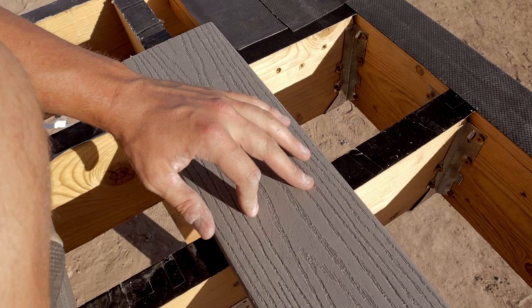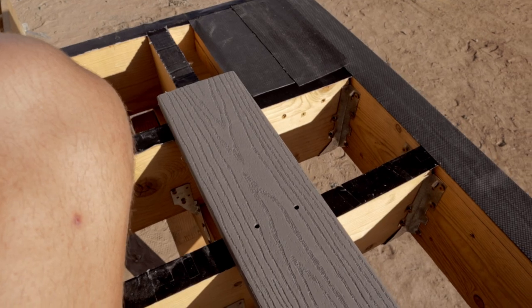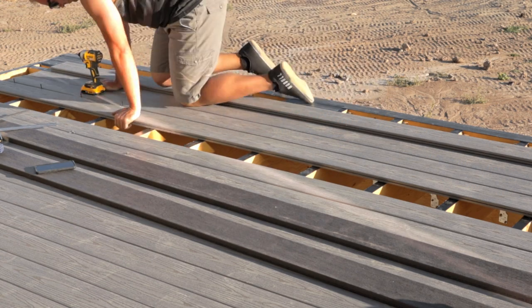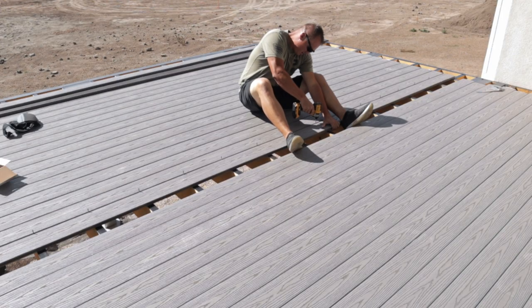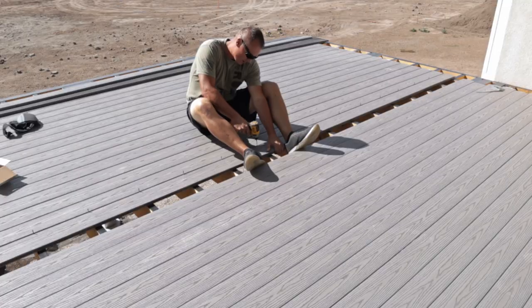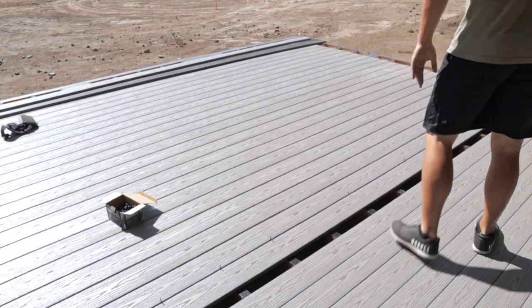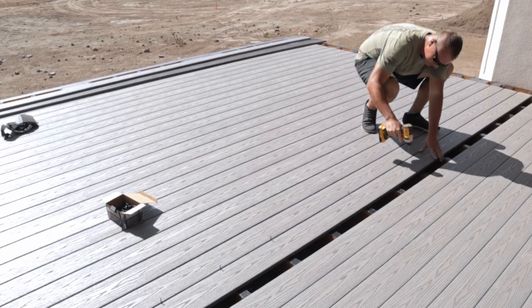They're hidden screws that go straight in and then you take these plugs and pop them right into the holes when you're done. The plugs are the exact same color as the decking — if you look close you could see them, but for the most part they really do hide them. First you drill the holes, sink the bolts in, and then you can put the plugs in. I'm going to wait to put the plugs in later in case I have to pull them out. After your first board is in you can use the Fiberon Phantom Universal Hidden Deck Fasteners to do the rest. When you lay the boards don't be too concerned that the edges are all in line — once the boards are all fastened down we'll run a saw across them all in a straight line so they look uniform. Now just get ready for a long day of screwing in hidden fasteners — no seriously, this takes a lot longer than you think.